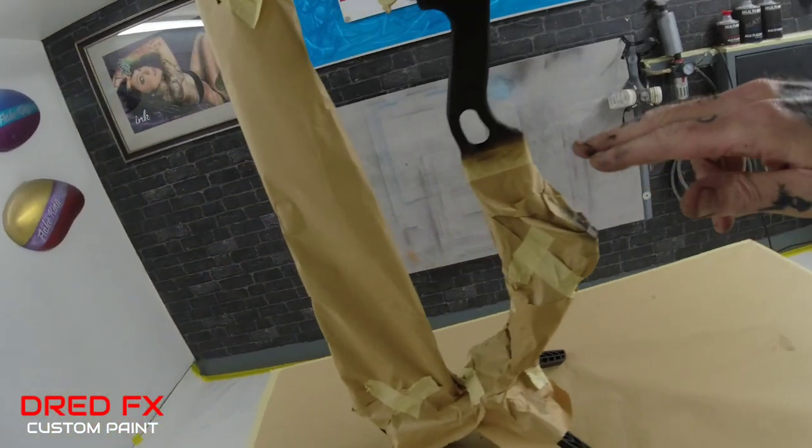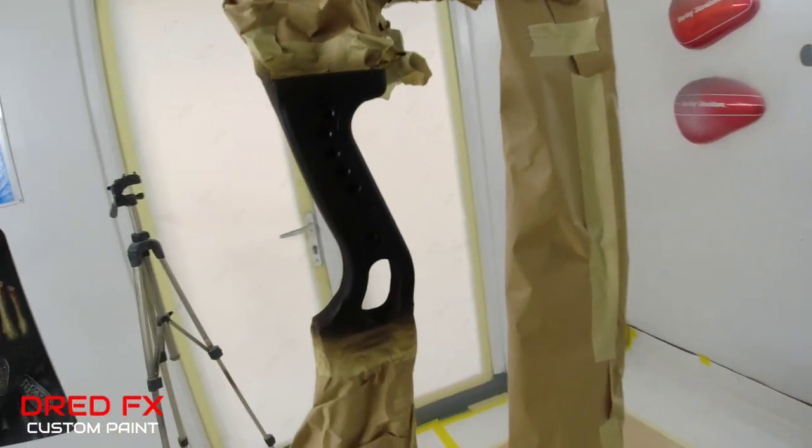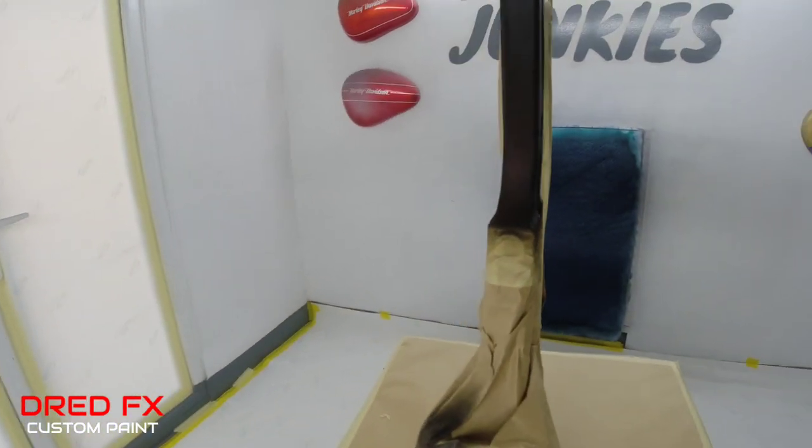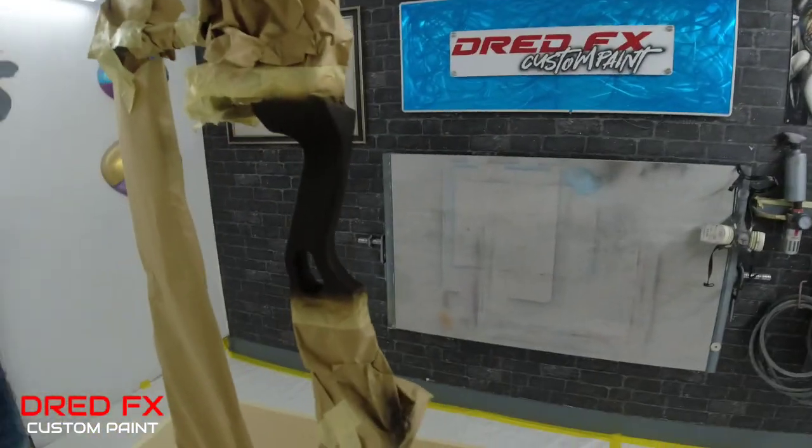Excuse me as I've got the extractor running. We've got the first coat of black down. So we dropped the etch down, nice light coat of that, not really heavy, just a nice silk coat all over, let that go off. And now we've got the first coat of black down. It's gone down a lot smoother and even using the brush instead of like an aerosol can. Aerosol cans tend to just build up really quick - you've got a little bit more precision and accuracy when you're using an airbrush. So we'll give this another couple of coats and they'll be good for clear coating. See you in the next timelapse.